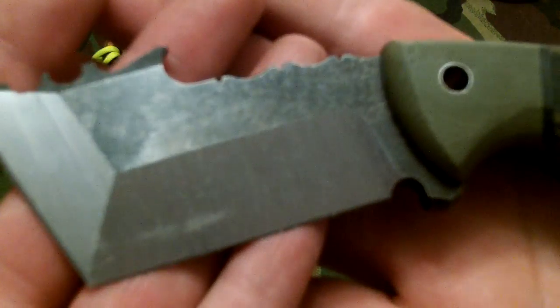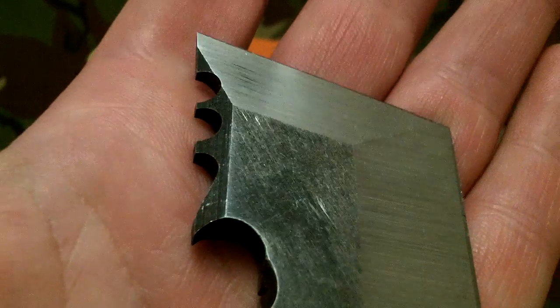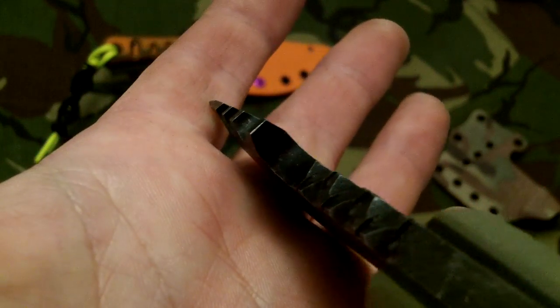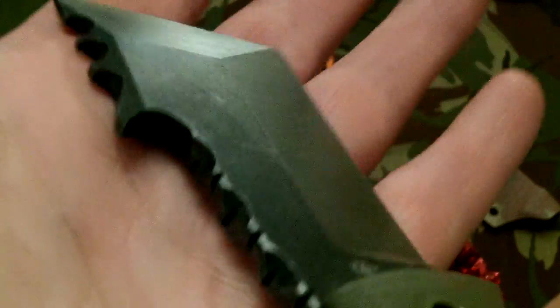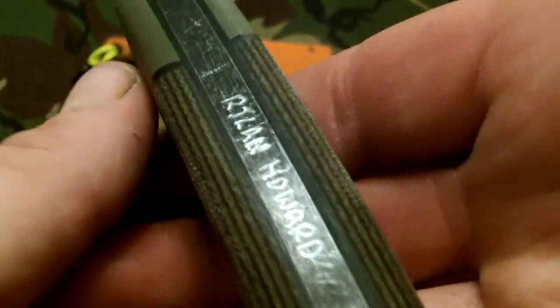There's the knife. Flat grind both sides. This is a true quarter inch thick. Quite an aggressive hook on the front there - which you need to be careful with Ryan, that is pretty damn sharp. Certainly made fit for purpose. Nice bit of jimping on the back there. Did make a bit of a mistake not using my normal angle grinder, so muscle memory's all out - it did cut a little bit into there. But it's part and parcel - handmade. This is not water jet cut or anything, this is all cut out with an angle grinder and carbide burrs.